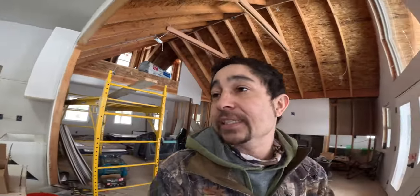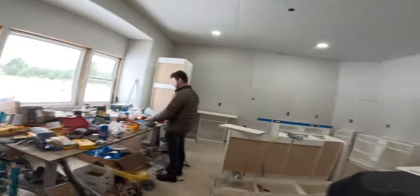For the next couple of days, we're gonna be working on insulation in the attic and plumbing. This weekend, we have a friend coming who's gonna help us get all the plumbing done for the inside of this house, so we can hopefully get an inspection next week — which means we can close in all our walls. We gotta finish stubbing the water lines up, and once we can do that, we can start heating this entire house. Then we can keep going on cabinets, drywall, and wood ceilings.